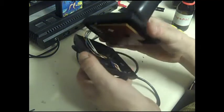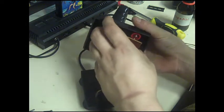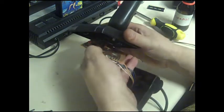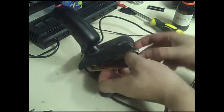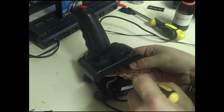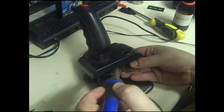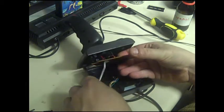Let's get this board out. The board is obviously connected to the bits in the handle that we just put back together, so our best course of action is to unsolder those wires to get this separated out. These little wires here - we need to desolder that one and that one. First one's off, second one's off. We can hook them out now - there we go, and that's the whole top of the joystick off.